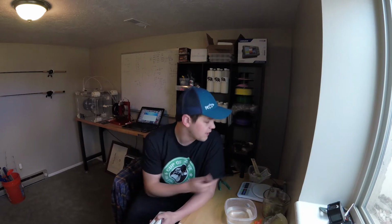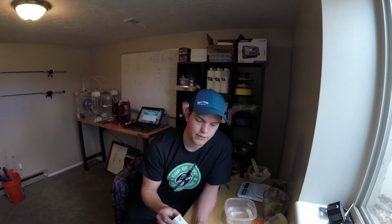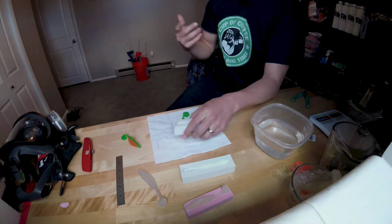I would like to experiment a little bit more to find out what viscosity is best. But basically, you just mix it up. If you only have the 24-hour epoxy, that's fine. That happens to be a 5-hour set, not a big deal. Coat your mold with the brush that's provided in the kit, or any brush you might have. Or you can just pour it in there and rotate it around a little bit. Then I'll leave it on an angle overnight over a Tupperware and let it drip out. You can see I got drips up on these, but that's fine, and that really smooths it out.